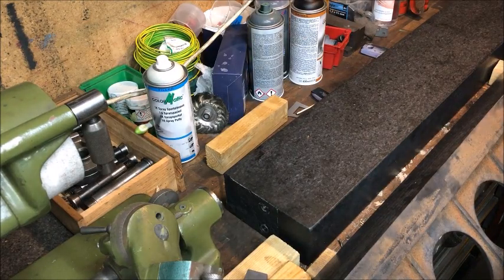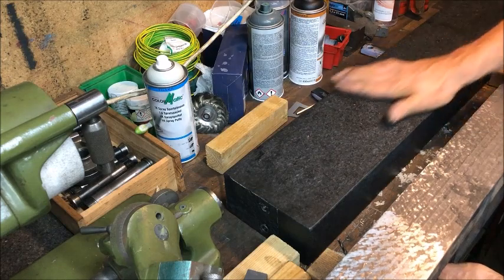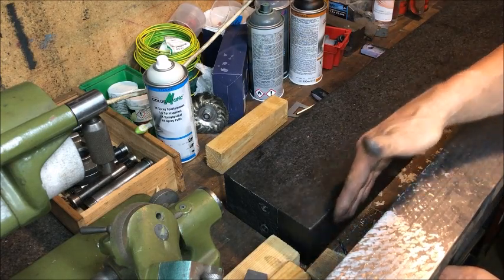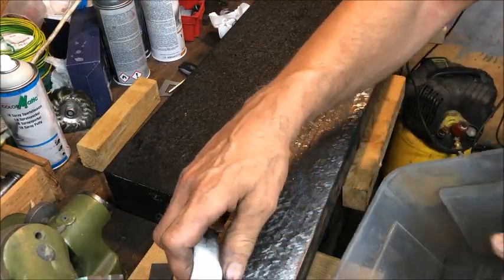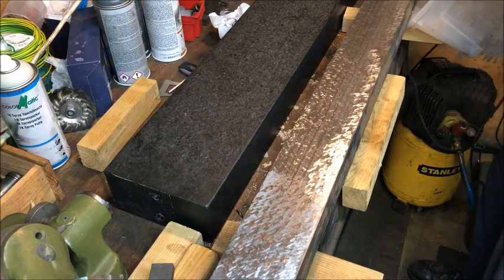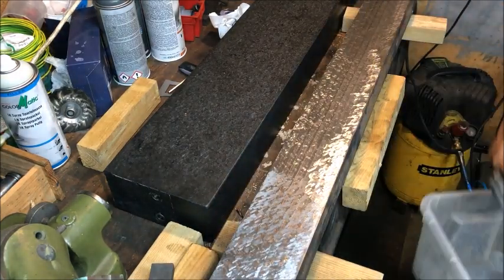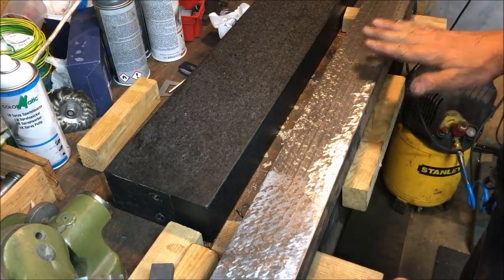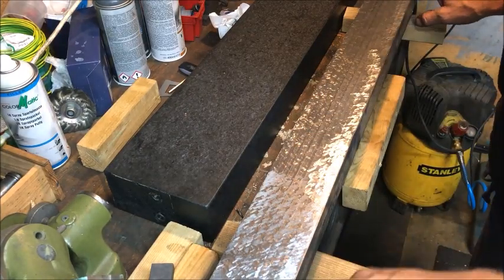For the observant observer, having the plate just behind here — if I cover it with blue, it's not a particularly good idea when I'm scraping here. So either we'll have to have some kind of cover here or move it to another place. In these initial stages, don't be afraid to just wail away. We have some cycles left, so to speak. There's no point in what Richard calls chicken scratching — just go mad at it. Rough strokes are rough strokes, to get down to where you can pinpoint afterwards.